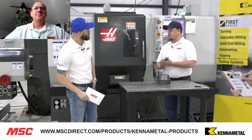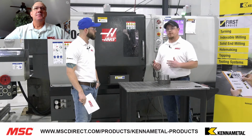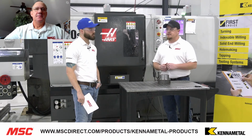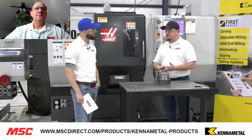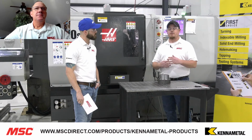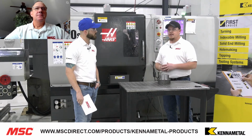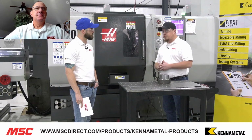Yeah, so like you mentioned before, we're going to start here in the DS30 lathe. We're going to showcase a couple different grades and styles of inserts here. We're going to do just some simple rough face, rough turn, and finish turn. We got two different parts here. We're going to talk about creating capacity. We're going to program it differently using two different inserts. I'm going to go ahead and get the program started.